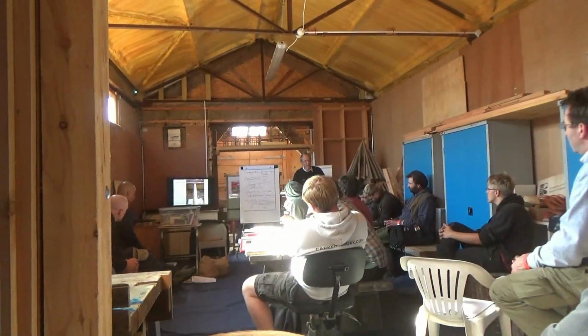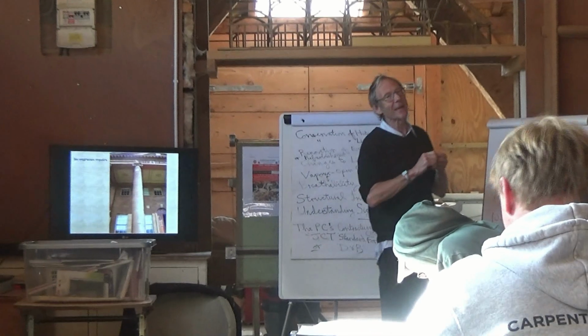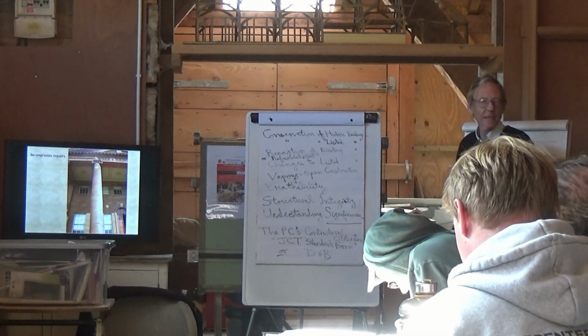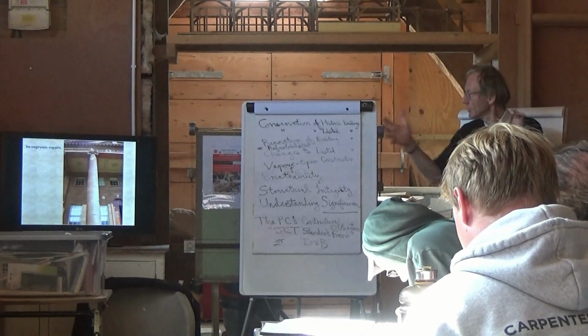Natural bleach. And OPC also tends to trap the UV light from the sun's rays. So what's going to happen is the UV and the OPC combination in that plastic repair is simply going to bleach the red colouring out of the stone dust, and you end up with some ghastly horrible thing up there that looks like the very devil itself.